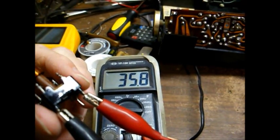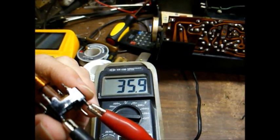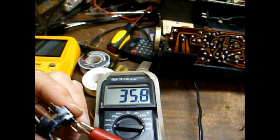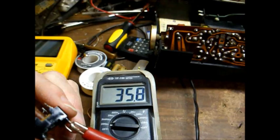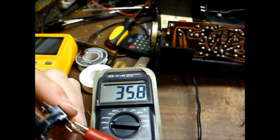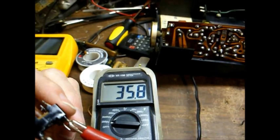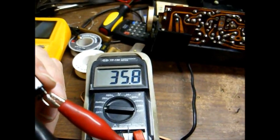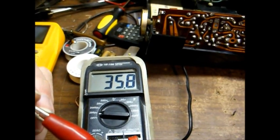The second way to do it is disable the capacitors inside of the original IF transformer, put everything back together, and obtain a couple of small variable trimmer capacitors and solder a capacitor across the primary winding and the secondary winding, and then adjust the trimmer capacitor for best alignment, and then carefully remove each trimmer capacitor without disturbing its setting, and measure the trimmer capacitor with a digital capacitance meter, and whatever value you measure is what value of mica capacitor that you need to buy.